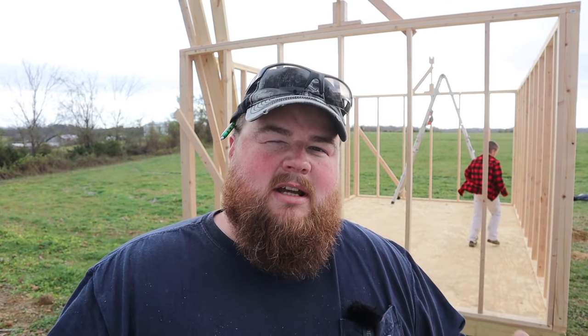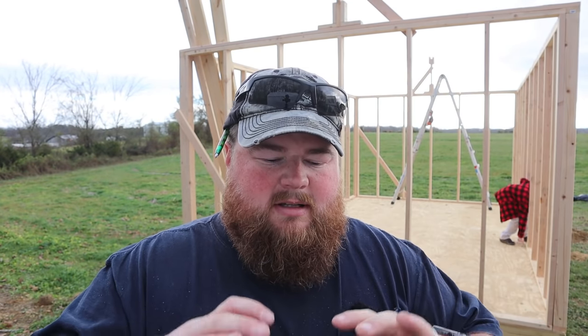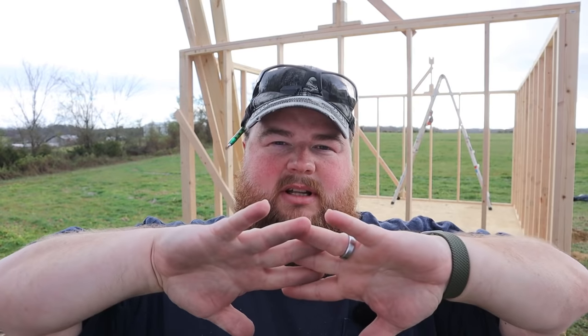Alright guys, both of our ridge support beam structures are in place. Now what I'm going to do is lay down my 2x8s that will form the ridge beam. I'm going to go ahead and lay them down flat on the floor, scab together with some pieces of wood, joining the two. Then my brother's coming over with his tractor, fancy John Deere front loader tractor, and he's going to lift it up and help me set it in place.